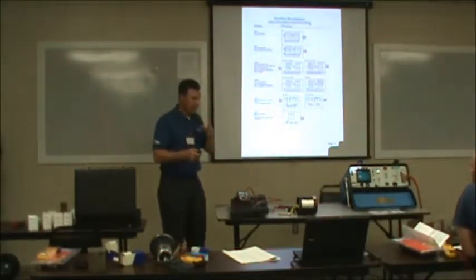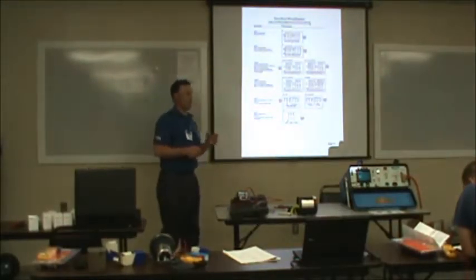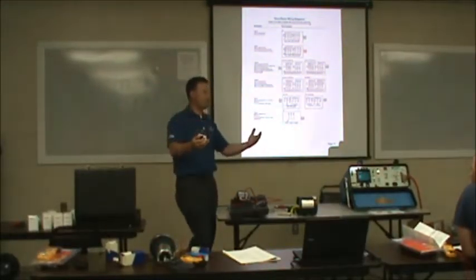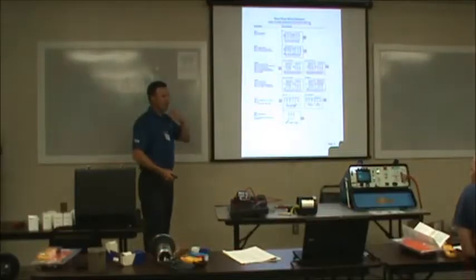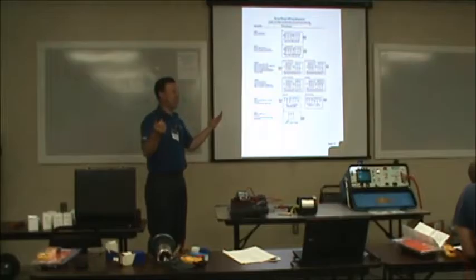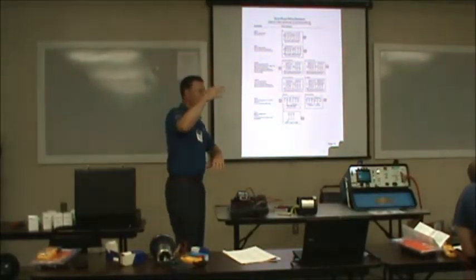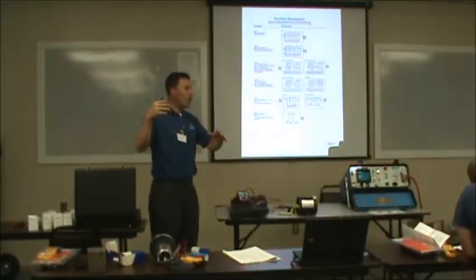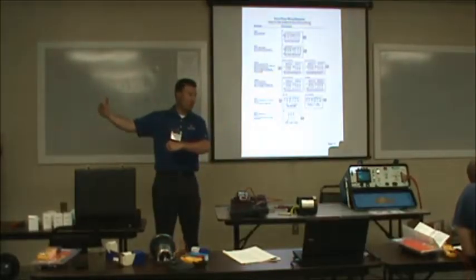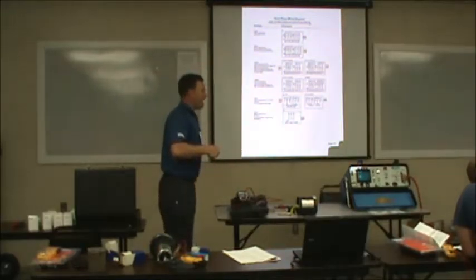Does that have to do with torque though, that Y gets more torque? No, actually less. It's an energy savings, a soft start mechanism. Say I've got a 200 horsepower motor, when I start on a Y, probably 75 horsepower on the Y connection. So I'm not going to get as many amps on startup. Now if you've got a constant torque application where you're starting a big load, it may not start, because it doesn't have enough power to start the load.